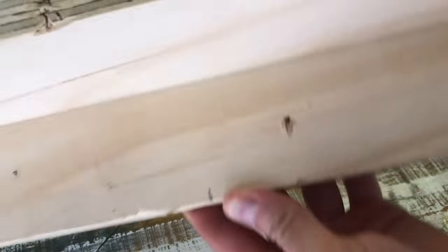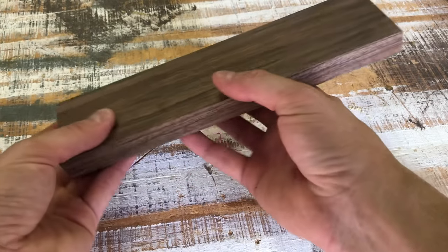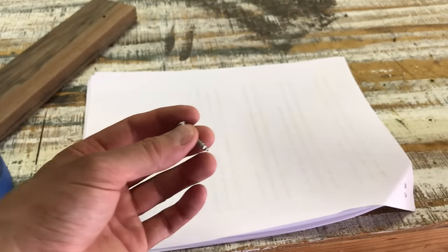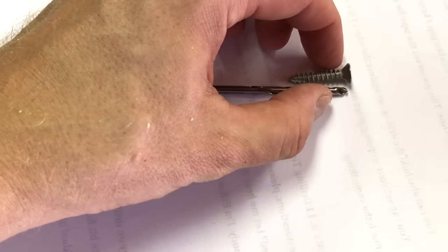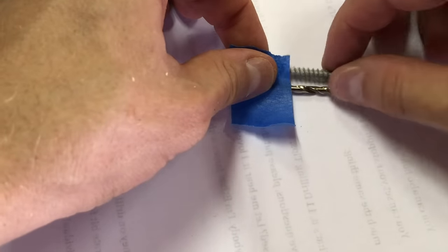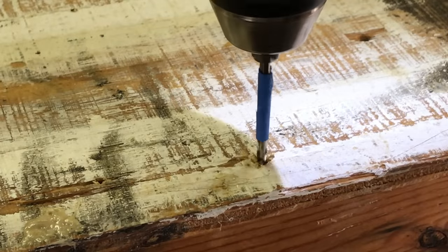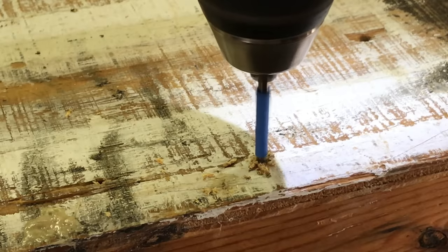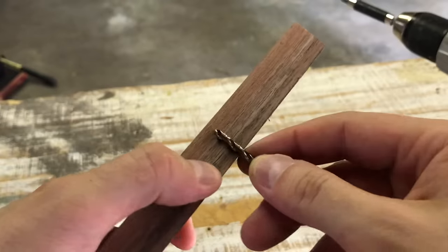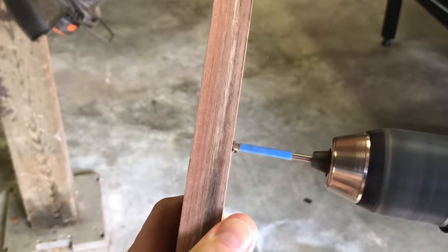And finally, one last tape trick. Tip number eleven: use tape as a depth marker. This tip is really important when you don't want to punch all the way through the material you're drilling. For instance, if you want to put a screw in the underside of a nice slab, you want to pre-drill enough for the screw depth but no more. Set the fastener up against the drill bit with the head resting on the tip, then take a narrow piece of painter's tape and wrap it around the drill bit where the fastener stops — I even leave mine a tiny bit shy of that mark. When you're drilling, the tape will give you an exact indication of the depth you need. Because I left that little hairline gap, I know not to touch the tape to the surface, but just to get it really close — this preserves the tape for more drilling. You can also hold the drill bit up against the edge of the material you're going to drill and set your stopping point based on the material's thickness.